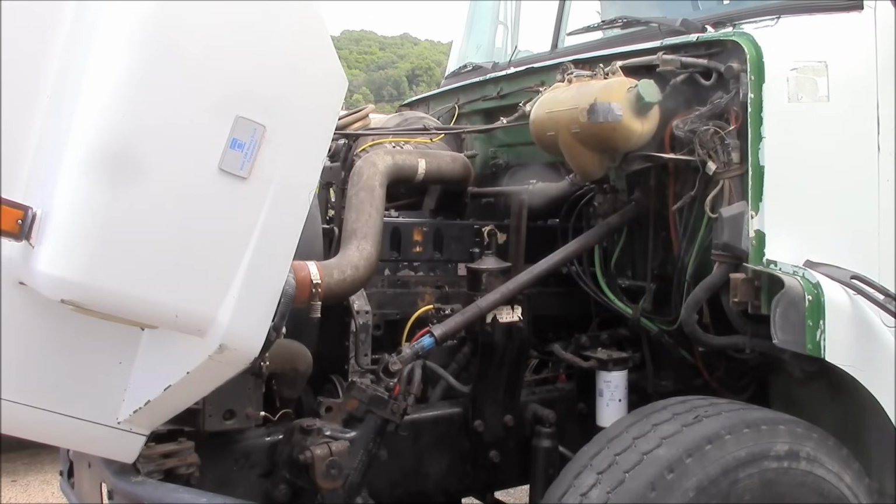And, you know, just from age too. It's however 25 years old, so wouldn't hurt to throw a set of injectors in it. And then it needs the rocker cover resealed. It leaks pretty bad over on the turbo side. So in order to do that, I think we got to pull all the rockers and everything off anyway. So be a good time to tackle that.